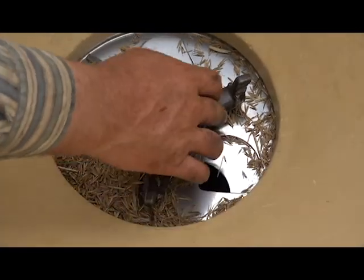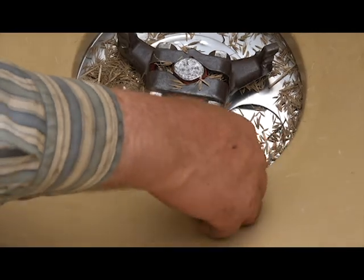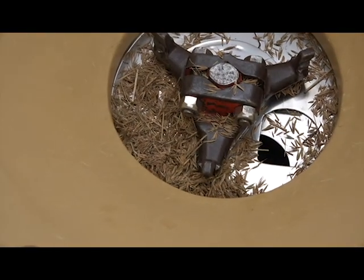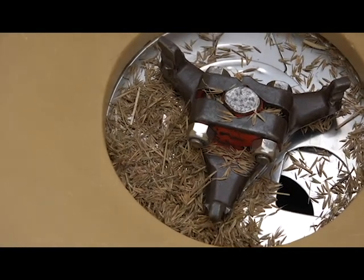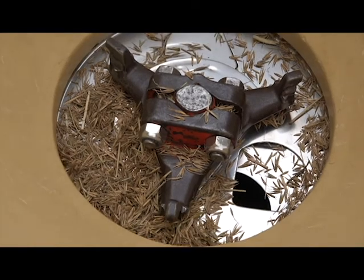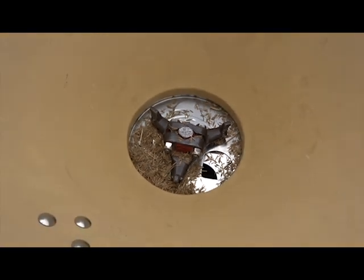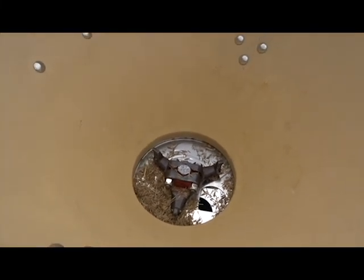It's quite a bit smaller than it was. So the seed there is going to flow out pretty good, but as we drive 5 miles an hour, it should come out, I think, about right. And that's why you try to preset it with a small amount of seed, because if you're wrong and it comes out too fast or too slow, then you go over your land again or have to go get more seed. So that's how you kind of preset it to your seeder.